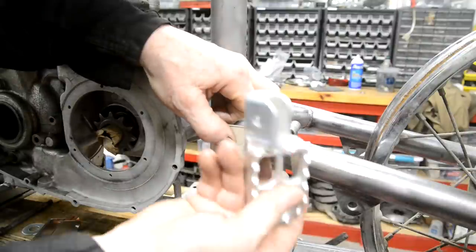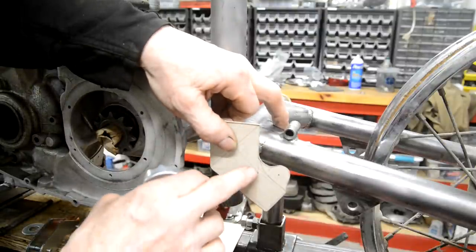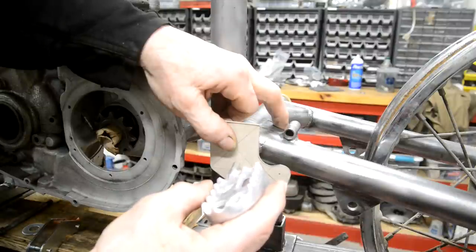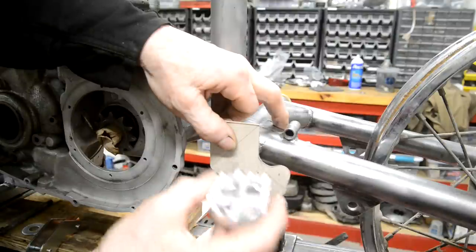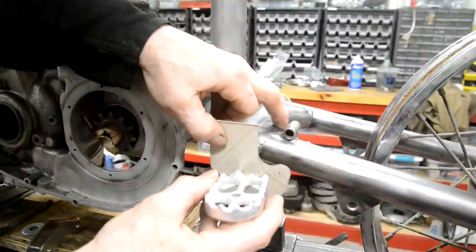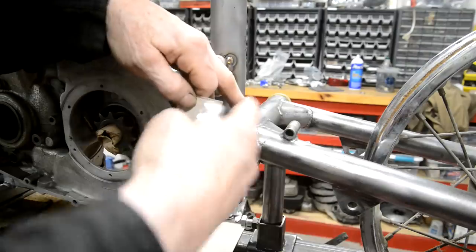Actually, it doesn't matter because, of course, this thing isn't going to be welded on there. There's a U-shaped bracket this bolts into. So I can make the whole of this, and then I can even just put the bracket on with a couple of little tacks, put this in and see what I thought of it. Could almost do it the very last thing. And then when I'm happy with it, like that. Because this could be anywhere on this plate. Doesn't have to be sticking out there. You know, I could have it up here if I wanted, as long as it didn't foul the nut. So we'll leave that for now. Let's get these cut. We can always reshape the end of this even after I've made the box, even after it's on the bike. None of it matters. So let's go and cut the top, bottom, two ends.